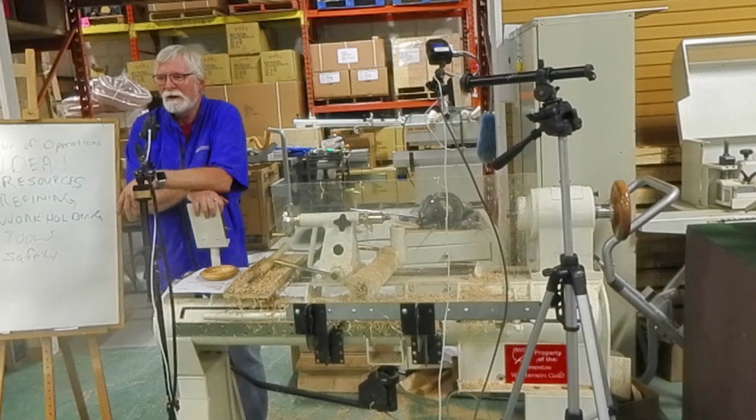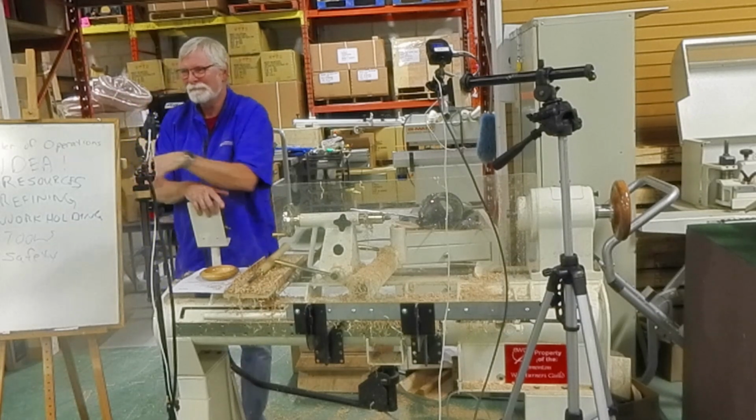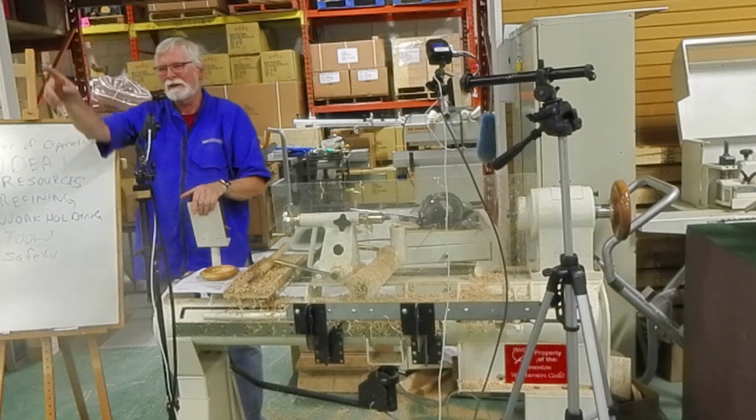Another thing that works reasonably well is just a cardboard box. If you're doing half a dozen green bowls at a time, put them in an appropriate size cardboard box, and it's mostly full, close it up. No, you just put them in so there's enough volume. There's enough moisture with all the bowls. And it slowly wicks out through the cardboard. So these guys are way more experienced than me. I just cut to a vacuum kiln because what takes people 3 months or 6 months or a year takes 3 days. Not kidding. And I'll attest, the vacuum kiln works extremely well. Oh, it's magic.